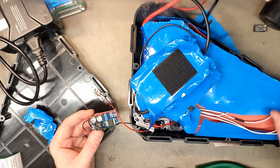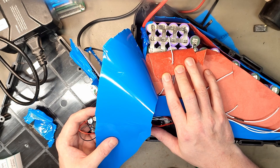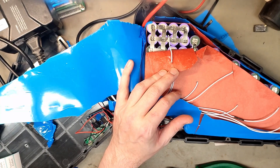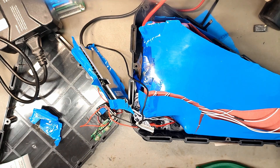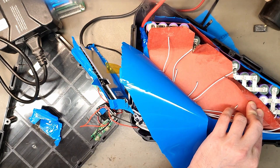We don't build battery packs this way, and if we did, there's just no good way to fit cells in here. We would like to use 21700 cells, but I think this case is made for 18650, so 21700 cells won't fit. Not my bad battery though — treat it well and maybe it will last a while. FST is not that bad; it might last 3 to 5 years, maybe shorter if you use it every day. It depends what you're willing to pay for a battery. Not the best we've seen, but it should be working when you get it.